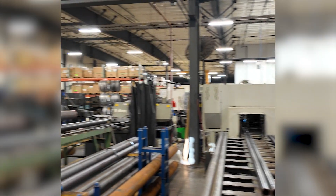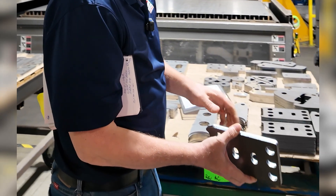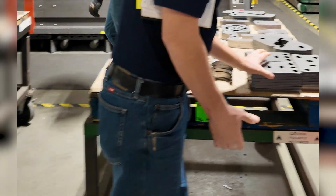This is where the steel comes in — the semis back in through that door. These tubes here are struts; there's all different sizes because they do RVs, buses, all sorts of stuff. This is step one: steel comes in, they chop it up to length and bring it over to the laser. They use a higher tensile strength steel to reduce weight in all their components — so thinner, stronger, and lighter.